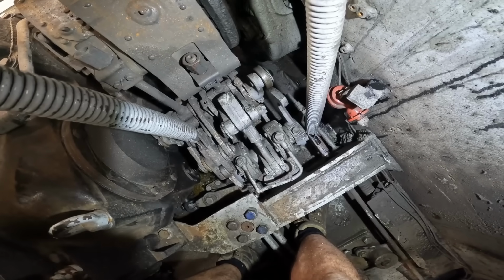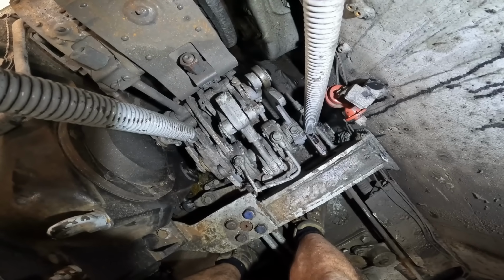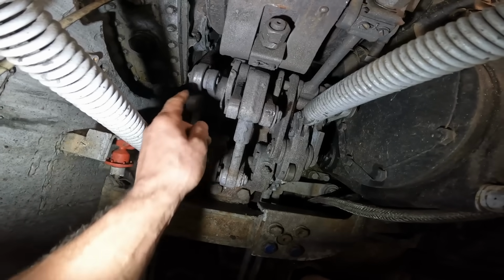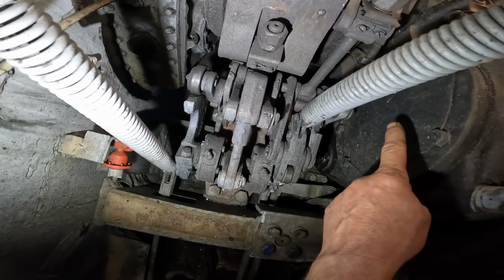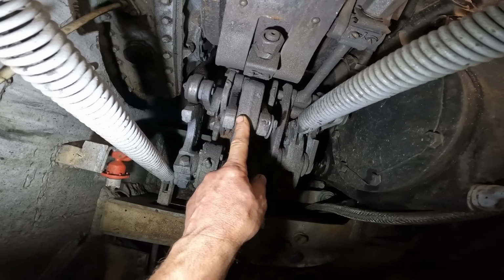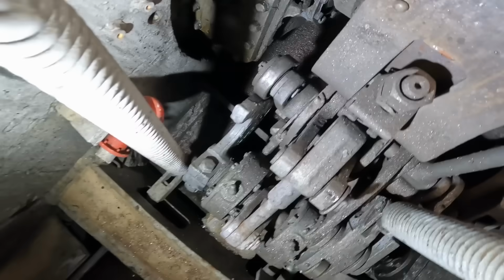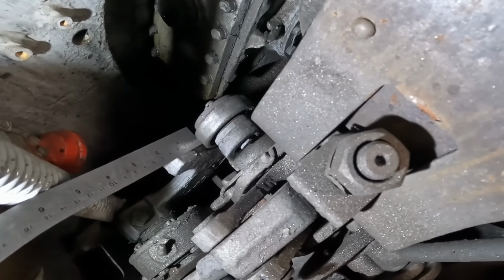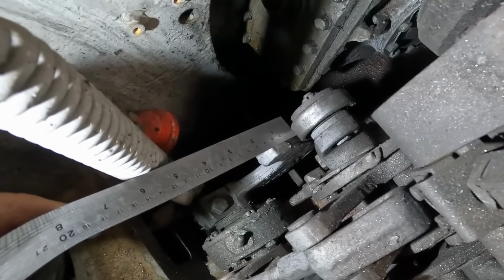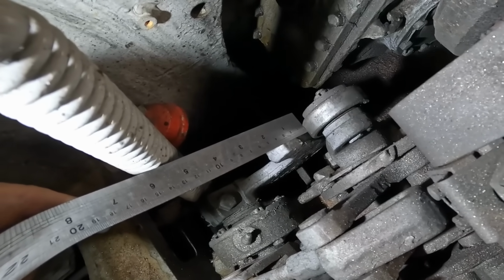Looks very much like a proto T54, T55 steering brake system. When you pull on the tiller, this cam here declutches the steering clutch and applies the brake band on it, but also releases the primary steering brake. And what I'm looking at here is the approximate amount of distance that roller is going up on its cam. So it's about 35 mil.